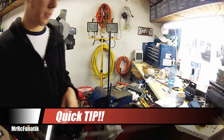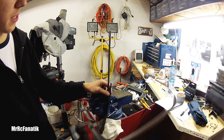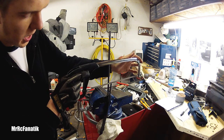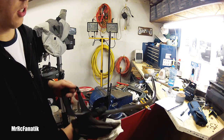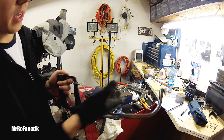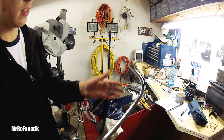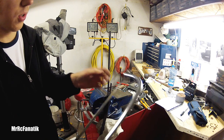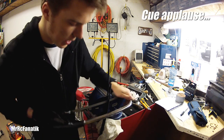Here's a quick tip I just thought of. If you're trying to cut a long, thin piece of metal like this and you're trying to use a hacksaw coming down, you can only cut so far. So what you do is take the hacksaw blade and twist it. So instead of cutting like this, you cut like this. You just unscrew the end, twist the little end pieces, put the blade back in, tighten it back down again, and now you can cut like this.